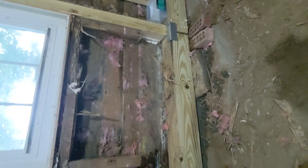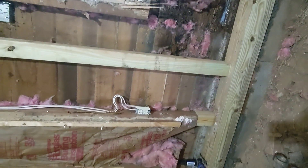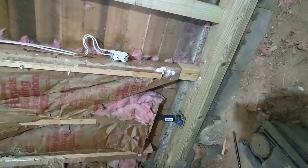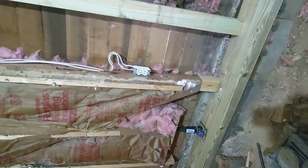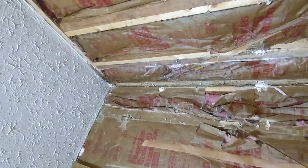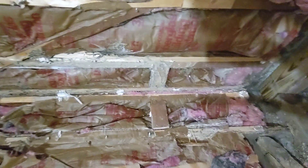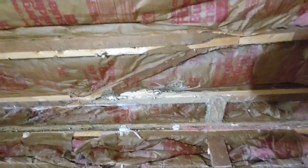Because when they first built this house, it was actually balancing just between the rocks, which I like the idea of it touching the whole length of the beam. But that big post right there is holding up most of the weight. We have that one in, and then I'll have to remove that electrical. We'll sister up this whole board. And then this corner is a big support post, which we're going to have to rip all of this insulation out. That post is pretty rotten, but it's a pretty important support, so we need to change that out.